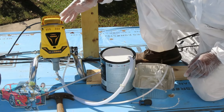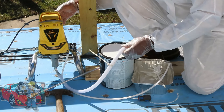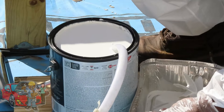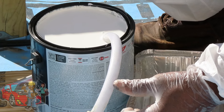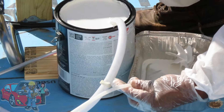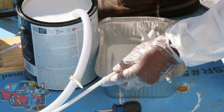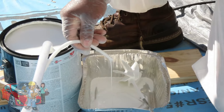In the back of the machine there's an on/off button. Watch carefully because what you're going to see is the paint start coming in through this tube, and at the same time I have my return drain over here. It's starting to come through — now it should start coming out of the return hose soon. Your unit is now primed.